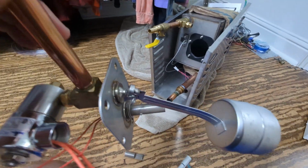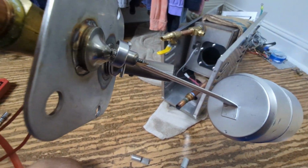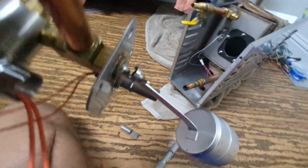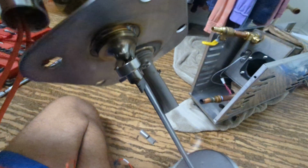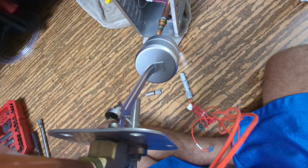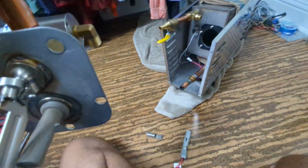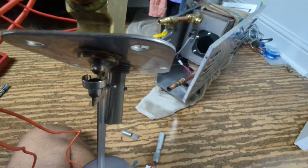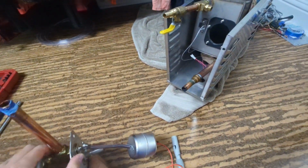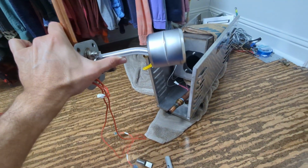And if you don't have an error 5, but you're getting water coming into the steam head and dripping, you're like, what's going on there? Well, that's because that little, see if I can get it there. You can just see that black gasket, and that gasket seals up against that orifice with the float. And again, as the float rises, that's what cuts off the water.